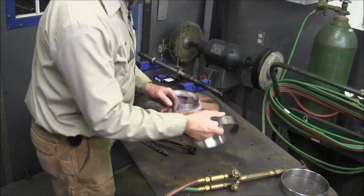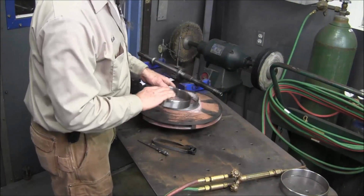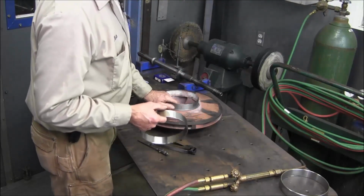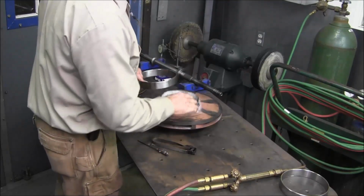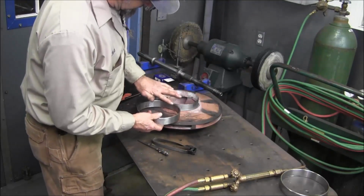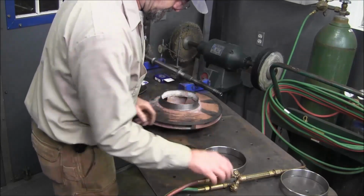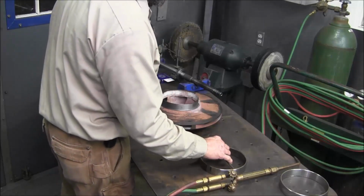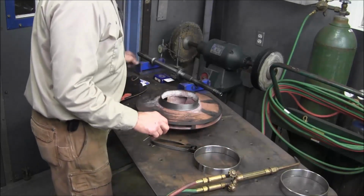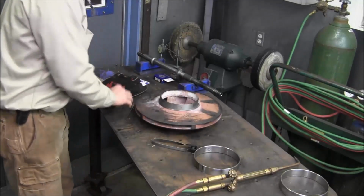Getting ready. We got our 2 rings. We're going to heat shrink them on each side, and then let them cool down on the impeller, and then we'll be setting up the impeller on the shaft to machine all the surfaces and face these off to the right length. So what we're doing, torch, we're already on. I've set my inside micrometers, and I have those dimensions written down so that when this passes through, I know that it'll slip right over the end of it there.